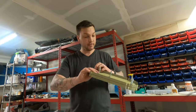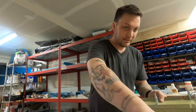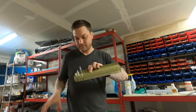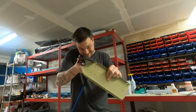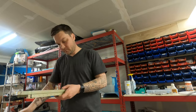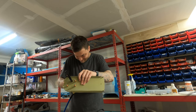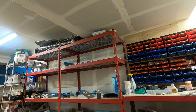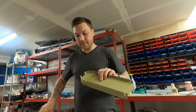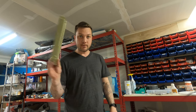I'm really glad we had the mistake talk earlier, because you're about to watch me make another one. When attaching the rear tie-down bracket, I did so using all six rivet holes, even though four of those are supposed to be left open for attaching the rear vertical stabilizer. Now these are going to have to be drilled out, but that's going to have to wait for a future episode. I'm up against my self-imposed time limit, which really bums me out because I have loads more footage from this long weekend of building. So keep your eyes open for another episode where we start to tackle the longerons. Eventually I'm going to get that bulkhead we skipped done, and soon we're going to start in on the aft fuselage. I want to thank everybody for tuning in, subscribing, for the thumbs up, and for the nice comments. I can't wait to see you next time here on RyanFlyze. The aft face of this bulkhead is all flush, and I believe the vertical stabilizer will come in and line up on that. 712 done, and with that the bulkheads are done — except for that missing one.